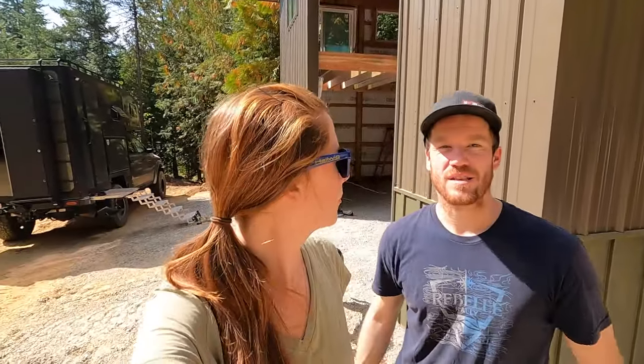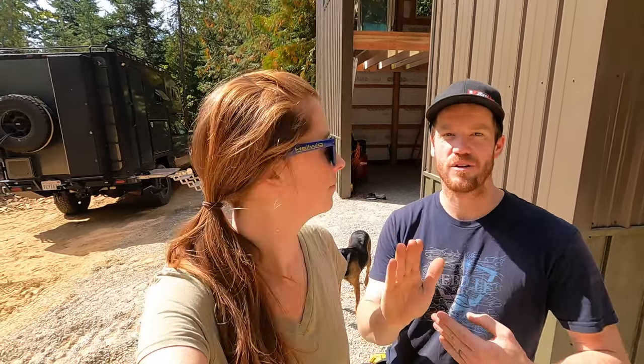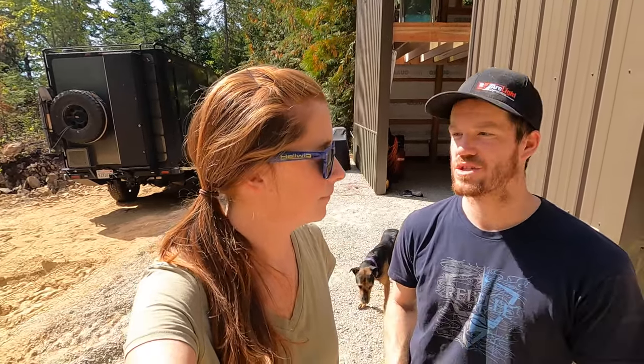Yesterday was a little frustrating. Building the second floor like this is another totally new thing to us. We knew what the finished product is supposed to look like, but how to get there wasn't really clear to us. And as we put each joist in, it started pushing the beam out until next thing we knew, we had a rainbow beam, and we had to take everything out and start back over at square one.